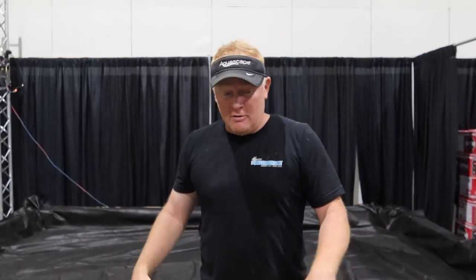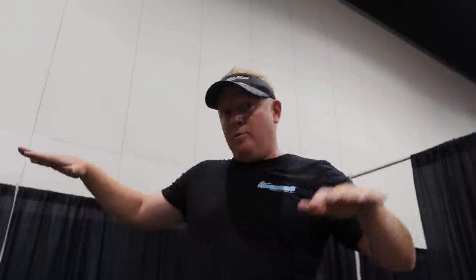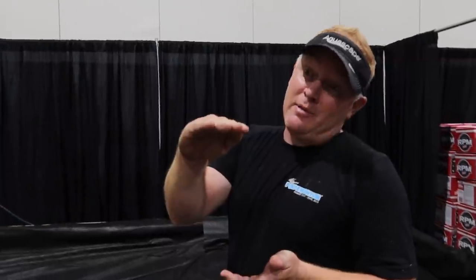But we've got our structure, right? So the wall is in all the way around. We're only going with 2 timbers high because all we have to do is hide a 9.5-inch high aqua block. That's gonna be supporting some stuff here and there. And that 9.5 inches is also crucial because it's probably the minimum amount of water we need to still allow our pumps to circulate correctly.